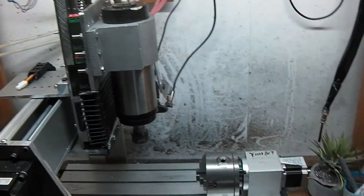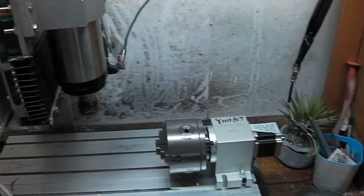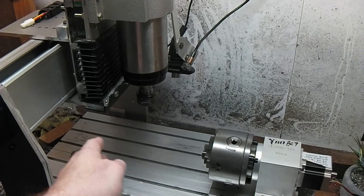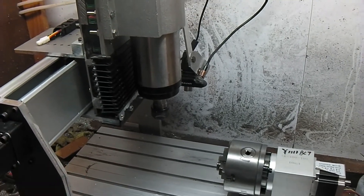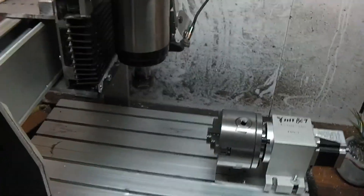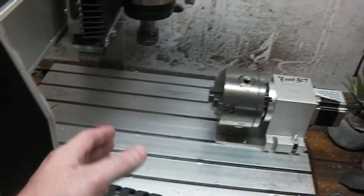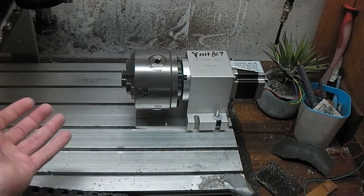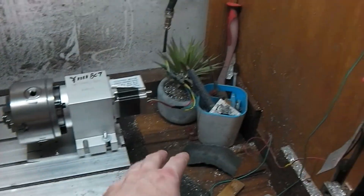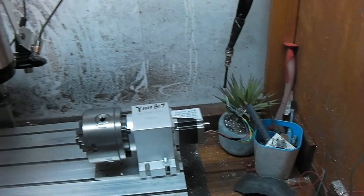On the plus side, the fourth axis here can actually slide in underneath the gantry now — clamps and things like that just didn't have the clearance before. The fourth axis can be positioned over there, which gives a fair amount of working area with a live end to work on fourth axis stuff — nearly as far across as it goes, providing a good working envelope for 4th axis operations.